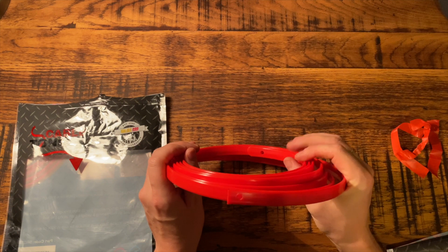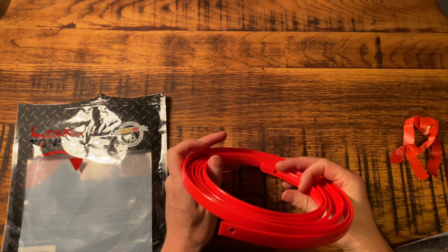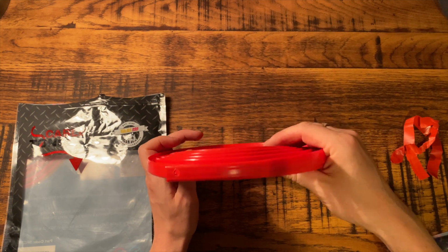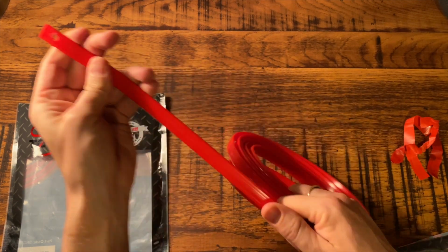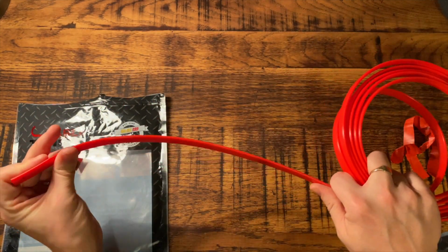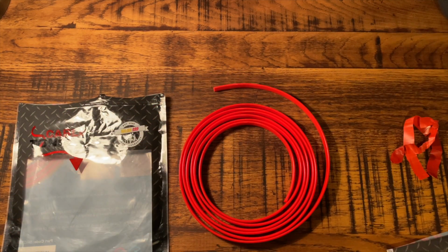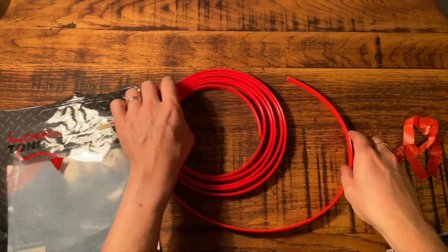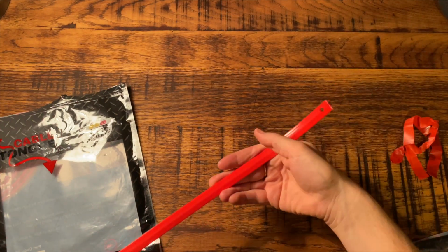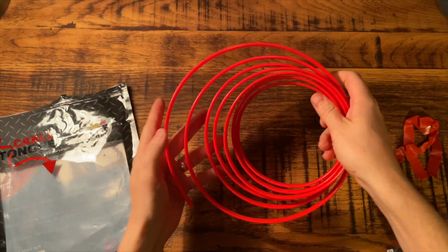I suppose it's a bit similar to a bit of trunking lid, like a lot of you have probably used in the past, and we did use that. But the trouble with trunking lid is it kinks up and can snap easily, whereas this is a bit more tough. So it bends back into place when you push it straight, it will push flat like that, but it naturally curves back into its shape. If I lay it down like that, you can see it stays in its shape quite easily, and you can just feed it into a hole or whatever, and then it will stay in a straight line. So that's the idea behind it.